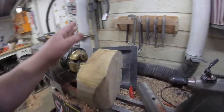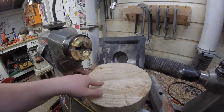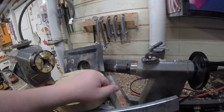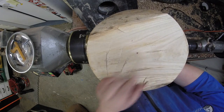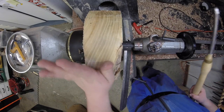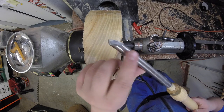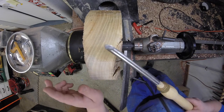We're going to be doing something a little different today. I've got a piece of American Elm that I roughed into a blank at the bandsaw a little while ago — it's pretty dry. We're gonna mount it flat up against the chuck, almost like a jam chuck, and bring up the live center at the other end to turn a bowl with a different shape. I'm gonna start turning with my 5/8 bowl gouge — I've got a swept-back Irish grind, the bevel's at 60 degrees, and I've made a second bevel called a relief grind, which makes the tool a lot easier to work with.